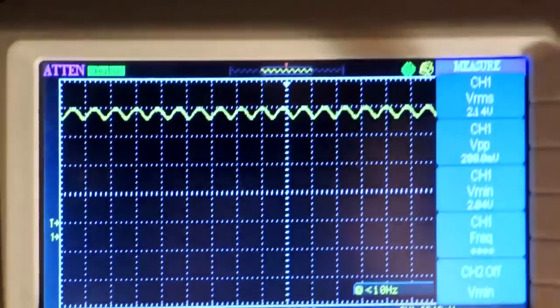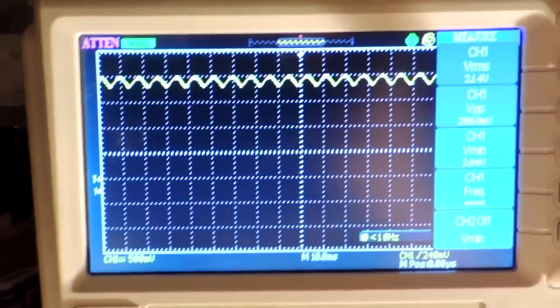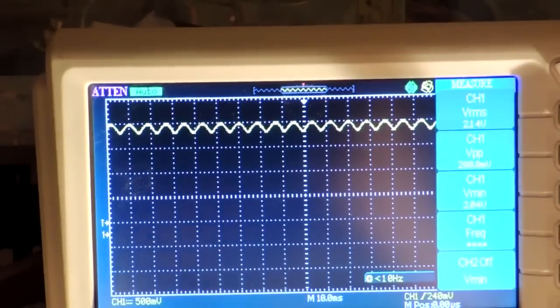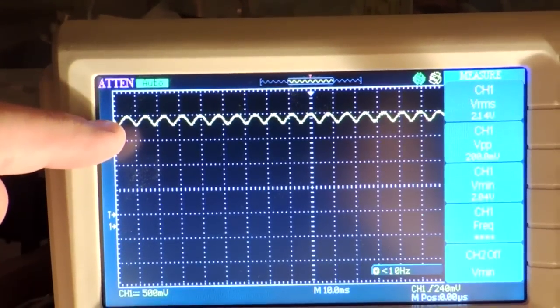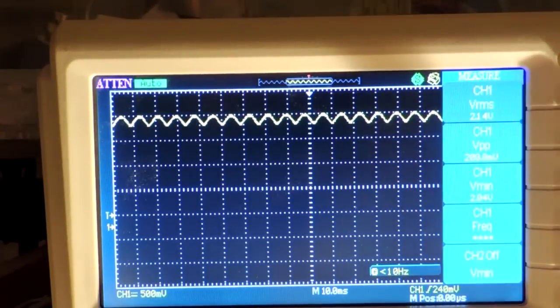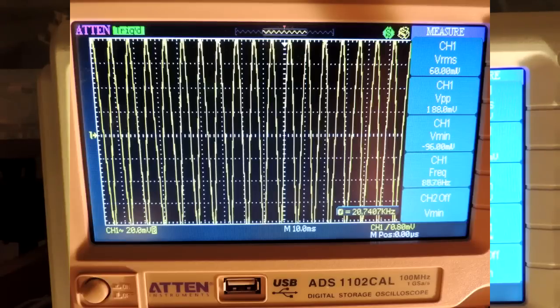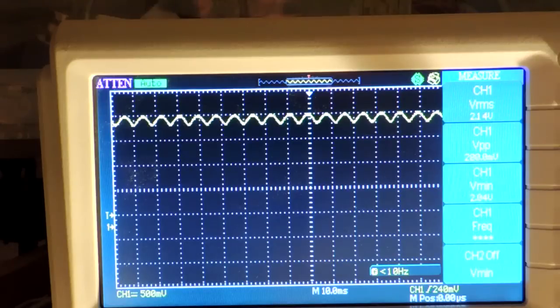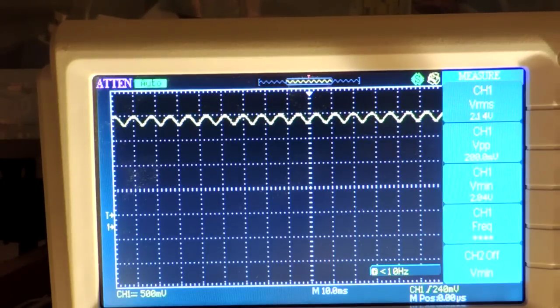Flicker test. I have a light bulb shining on a solar cell, which creates a voltage. Looking at the output on an oscilloscope, you can get a sense of whether the bulb has flicker. There's clear evidence of flicker here — a DC offset from the light striking the cell, and an AC component which is the flicker. Comparing the zoomed-in AC profile of the Cree bulb versus the Philips, the Cree bulb seems to have greater flicker. So a point goes to the Philips bulb — however, neither is acceptable. I don't like flickering in my bulbs.